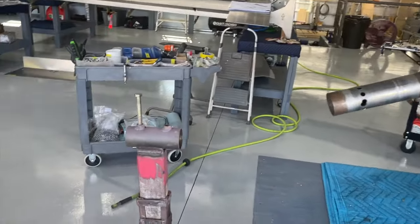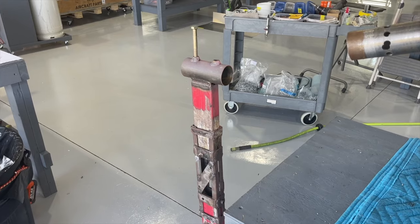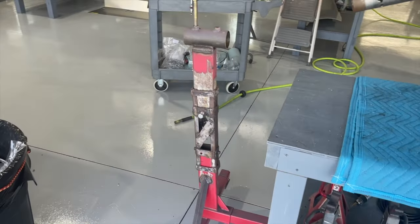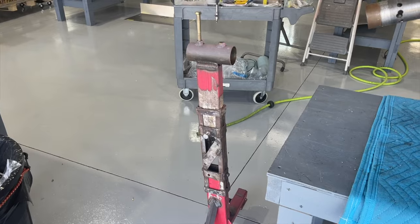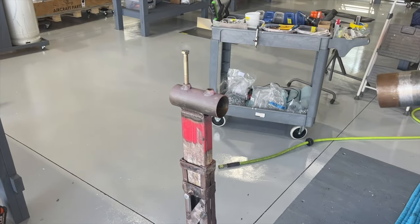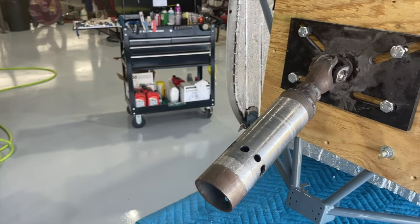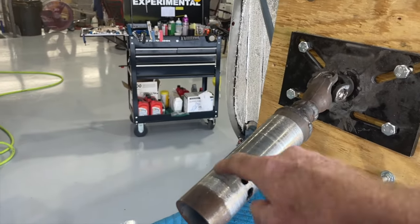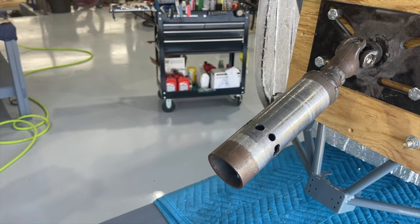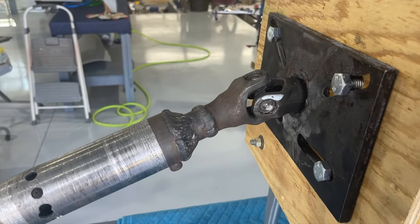Let's start here with this modified engine mount or engine stand. This is just a Harbor Freight engine stand. I modified it to give it a little bit more height. It's got a tube up here, about a three inch tube as a receiver. I've got this tube here that fits inside, and these holes are for a pin. When it rolls in a certain position, I can drop the pin in there and hold it in place. I've attached the U-joint here to stop any kind of binding.